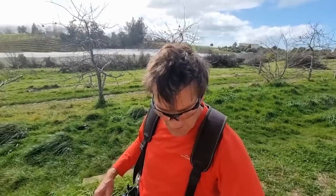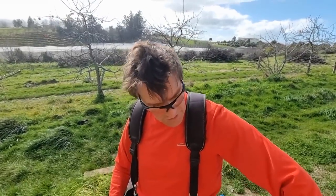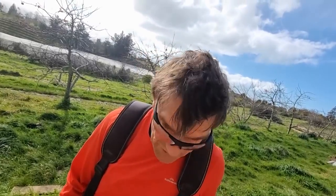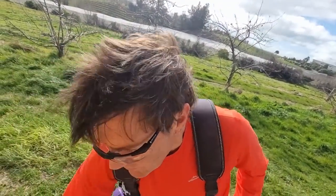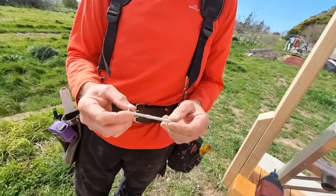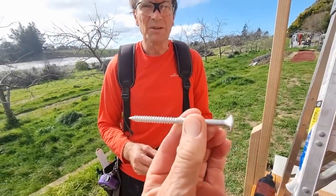So when we'd do temporary scaffolding, we'd nail a plate onto a stud and we'd put a plank on it. So one nail would hold a ton. So you imagine what these 6 mil screws hold. Heaps. They've probably got a whole ton and a half because they're threaded as well. So you put two of them and then there's three tons.